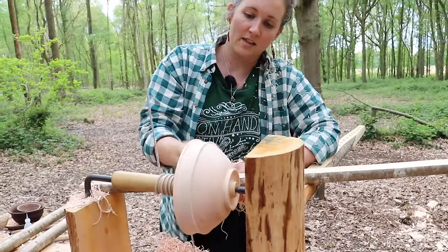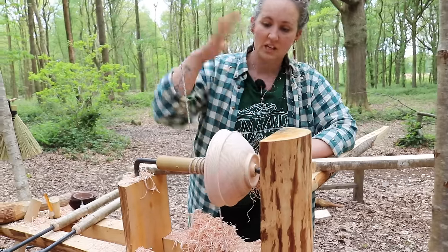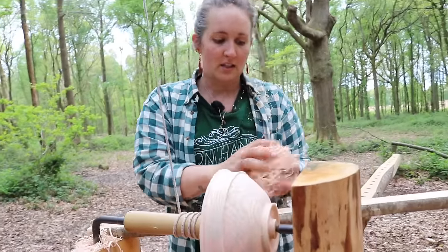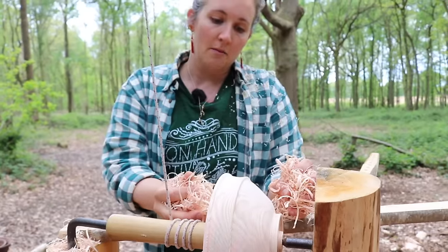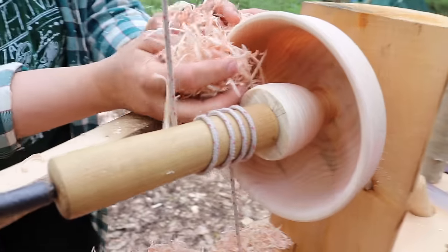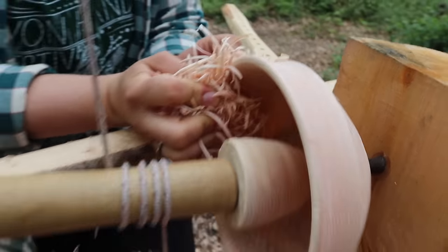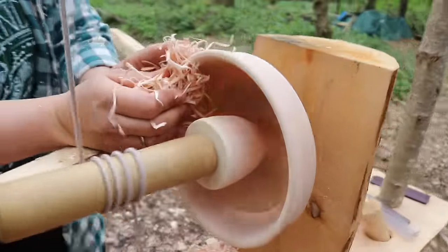And then when it goes in and out of water, if it's been sanded, the fibers lift. That's why some people don't like eating with wooden spoons, but a tool finish is really good. But if you're finding that there's still some bits, sometimes burnishing with some wood shavings works, or I've also used a little piece of wood or a stone, but you want to be careful because your hand is going to be inside while you're turning. So I'm going to take a bit of this just to show by example, and I'm putting equal pressure between my hands. I'm not pulling on the bowl at all, but I'm just going to run it over the edge. If there were any fuzzy bits, it might get that off.